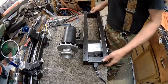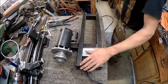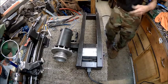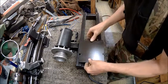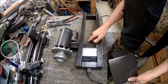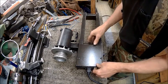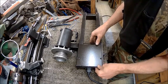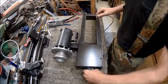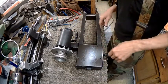And mount the lathe to it. Now I've also made another plate for this, and I'm going to call this a deflector plate. So basically what that does is go right there on top of that, and it's slanted down right here to keep shavings from going down in here. So this will mount and sit right there, then we'll set the lathe on it and put our bolts in it. I'll go ahead and put this lathe on here and bolt it down.